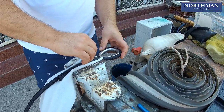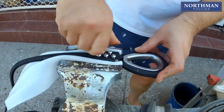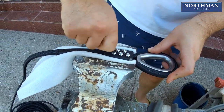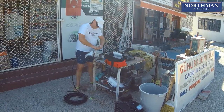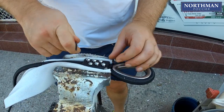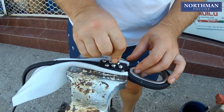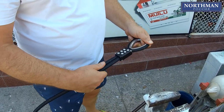When assembling the rope clamp, do not forget to use some soft spacing material to protect the coating from scratches. First, install corner screws and then locking screws that punch into the rope for better holding. Gradually and evenly turn the screws, but do not force them if they are going too hard — you will be able to resolve this in a bit.